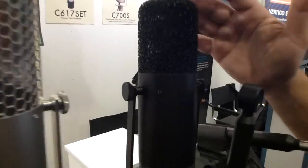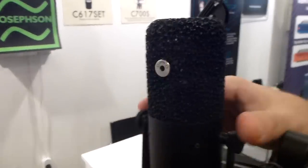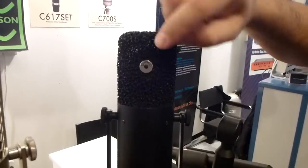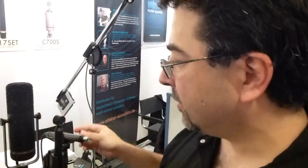We also have a mic that precedes this one, which is similar in look, but if I turn it around for you, you can see on the back it actually has a hole with a screw that goes in there, and you can actually adjust it from cardioid to omni. This is a single-diaphragm microphone called the C715. It has a capsule which is acoustically our take on the Sony C37 capsule — assembled in a significantly different manner more in keeping with our style, but the holes and acoustic chambers are similar and have a similar effect.